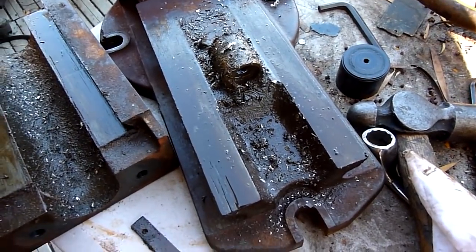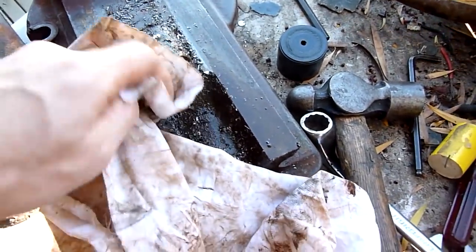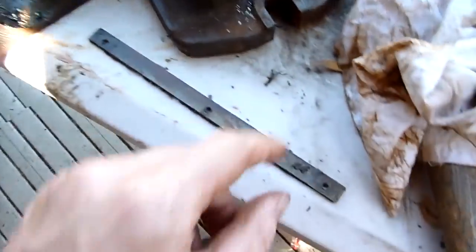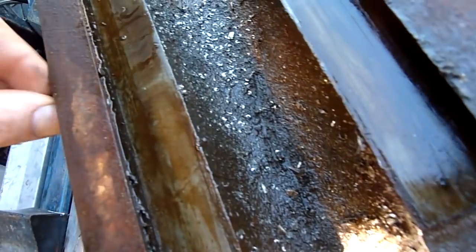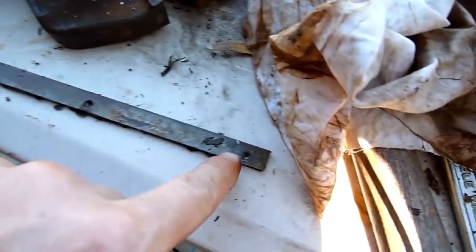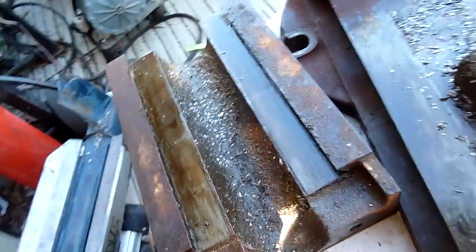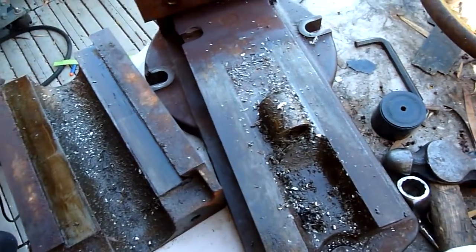This old girl hadn't been cleaned in a while — there's your weekly dose of greasy machine shop schmoo. There's the gib strip which puts tension on the slide and takes all the slop out — wiggle wiggle wobble, nice. Looks like there are some little studs in there that come out too. Not just grub screws, but also some little push pins that bear upon this, so you've got some slightly offset angled holes. That has to go back in the correct way, along with all these little pins — one, two, and three. I'm going to make absolutely sure they all end up in a ziplock bag with a bit of auto-trans fluid in it.